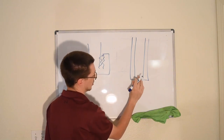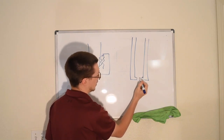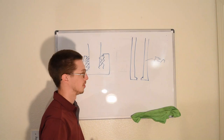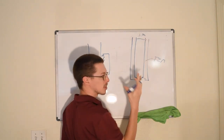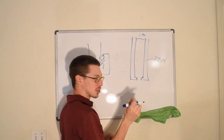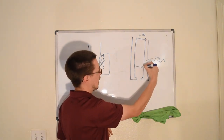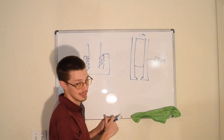And so we're ending up with something that looks essentially maybe more like this, because the drill has a point, but yeah, more like this. And this is a TZM molybdenum alloy material that's been drilled, and this width is maybe 1.7 millimeters, maybe somewhere between 1.6 and 1.7, just slightly larger than the diameter of the wire feedstock that we're using, because we want essentially the wire to come down to this section, and when it reaches the end of the die, it has nowhere else to flow but out of that orifice hole.